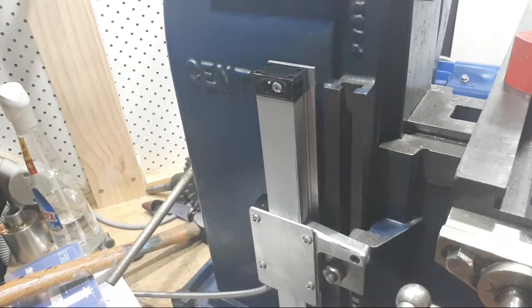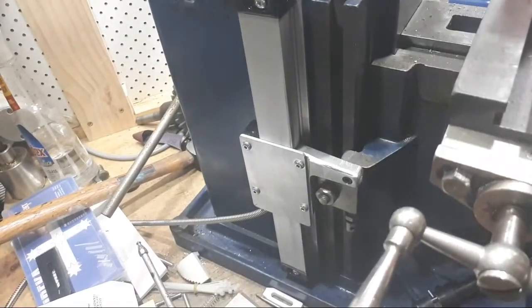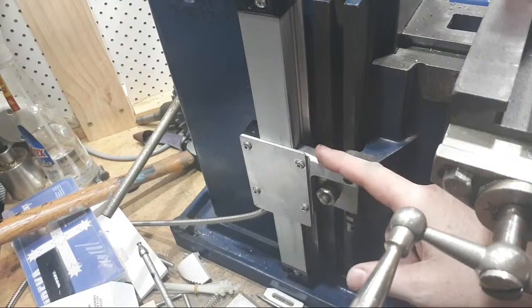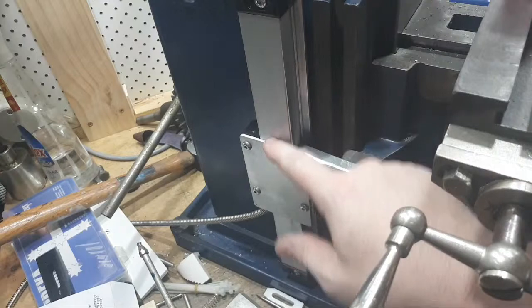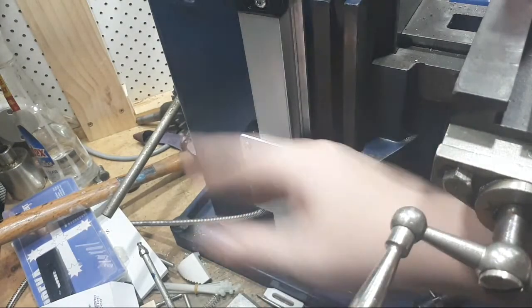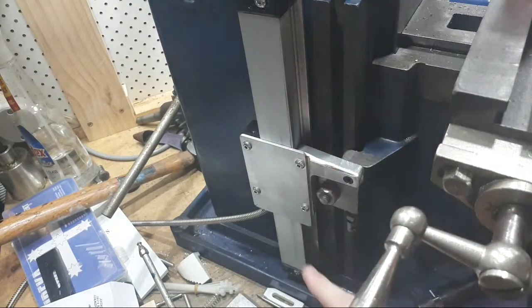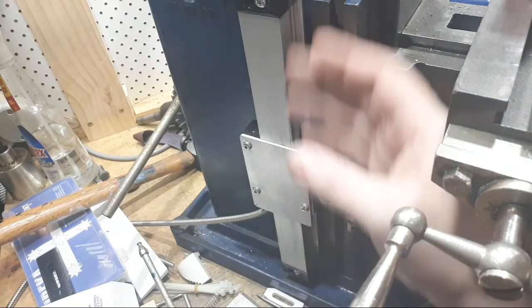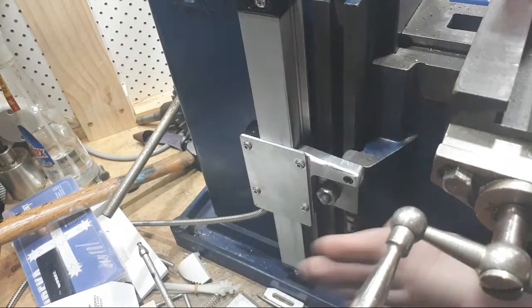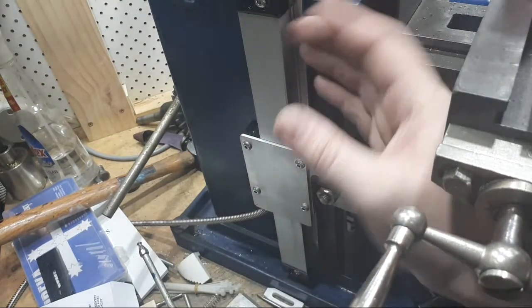What have I done this weekend? Set up this DRO, which is a bit of a mental health project, really. I'm probably not going to do a video on DROs. I might do a bit of a video, but probably won't. Put this glass scale on here. It's on two spaces. The problem with this casting is that it's curved this way as castings are, and it's curved this way as castings also are. So it's got a bulge in the middle, and if you put something on here and on here, not only does the plate you put over the top of them not line up, but nothing else lines up either. And it gets a bow in it when you tighten it down. So I made two little spacer washers to go, one here and one here, and I put two set screws in them for jack screws and adjusted them until they were right.